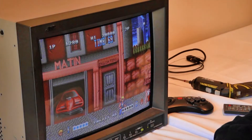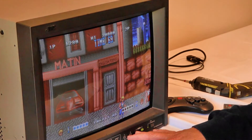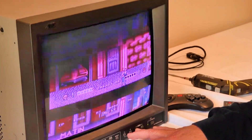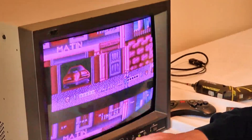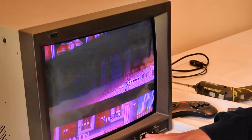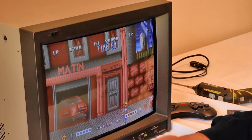One thing I'll note: as I mentioned before, if I press the C button, the CRT will think it's switching to component. So the sync will drop out and I'll get that purple hue, which you would expect when you select component instead of RGB. I can test it, but I'm pretty confident that won't be an issue. Just to show you that that does work as well.